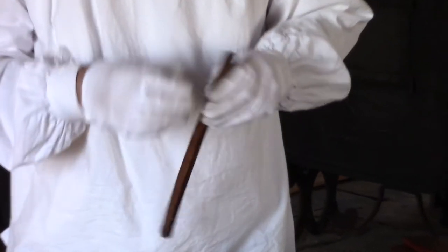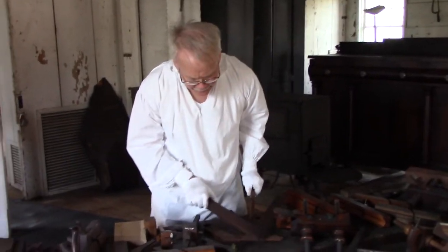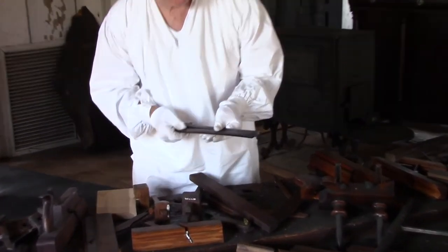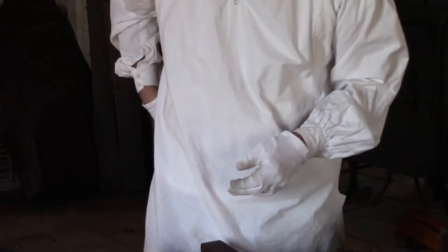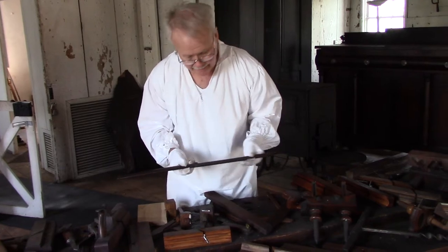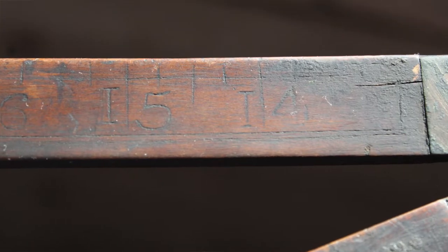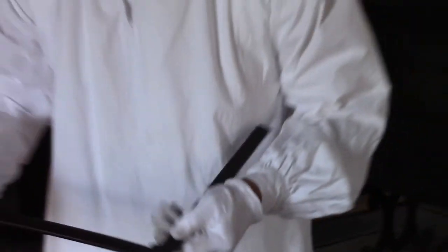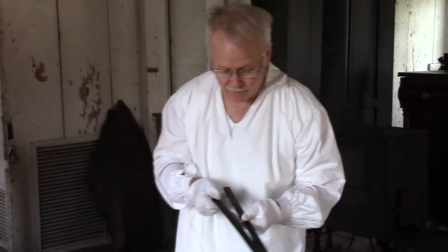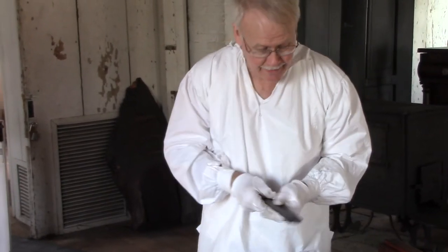This is a folding rule that I'm afraid to open. It's in pretty good shape — can pretty well read it easily. There's another ruler here, and this one is really neat. What the cabinet maker would have done with one of these: they'd probably put it in their pocket and get it out 200 times in a day. It folds out like this, locks like that. The numbers are here — it's hard to read, it's very old. But this would be for linear or straight measurement. Modern people like tape measures and they work very well, but these kind work better for some things. There are even a couple of pins here that hold it steady when it's folded up in your pocket. So you've got straight measurement.